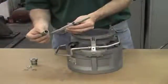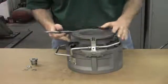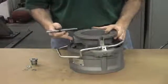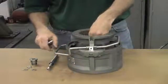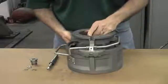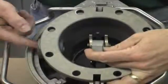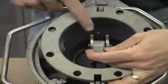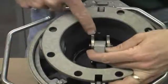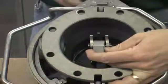For the reassembly, start with the shaft and the spacer with the hole in the body on the right side as you are working. Take the poppet and pull everything up. An important note: you want the orientation of the hole in the body of the coupler to your right as you are working. Also pay attention to the position of the links — they will be closer to you. This orientation is important as a reference as you work forward.